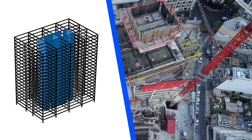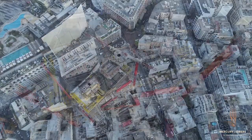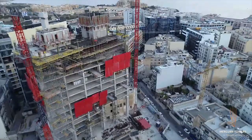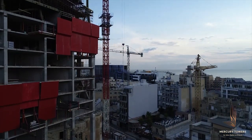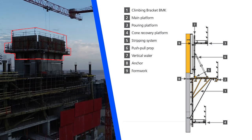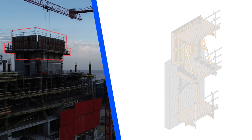The surrounding concrete frame changes to a surround brace in the middle of the tower to create the architectural shape. Sliding concrete formwork is used for concreting the internal concrete core. In this type of formwork, each executed part of concrete is used as support for the formwork of the next part of concreting.